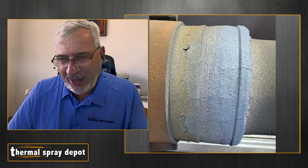There's something called gun bluing that a lot of people are probably familiar with. In the old days, before they had fancy chemicals to do bluing of steel, they used to do bluing of gun barrels to prevent corrosion of the barrel. The way they did that is they heated it up to about 600 degrees Fahrenheit. This chart shows what tint steel gets when you heat it up to a certain temperature. On the very bottom you see 410 degrees Fahrenheit — that's a straw-ish color. Then you go up higher and you get that dark blue at about 550 degrees Fahrenheit. That's our first clue — we know what temperature this part saw. The center part where the main thermal spray was put on is blue — that's the hottest. If you go to the left, you can see it gets down to the shades of gray and gold. So that's our second clue that this thing was pretty hot and the temperature naturally dropped off.